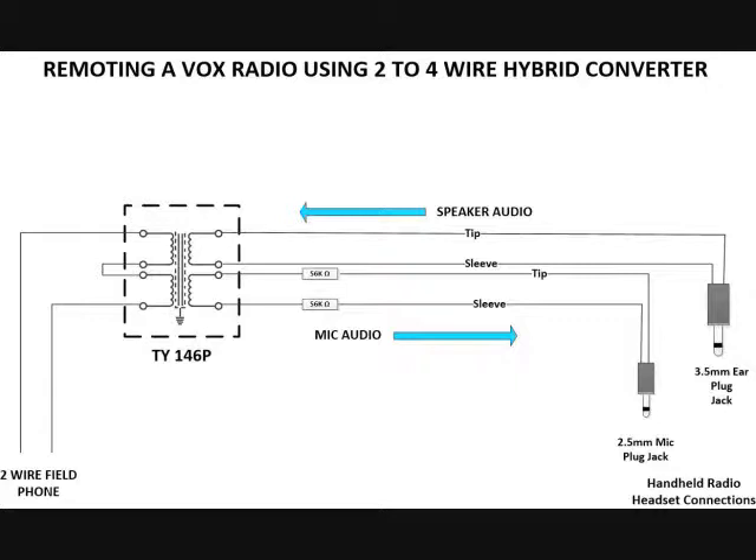I put in two 56K ohm resistors because it was having some problems with overdriving. This is not a high fidelity stereo system, so I don't think I'm going to spend the time to figure out how to build a matching bypass filter. Just use the two 56K ohm resistors, make sure you set your volume levels right, and you can pretty much get away with the feedback. It works good.